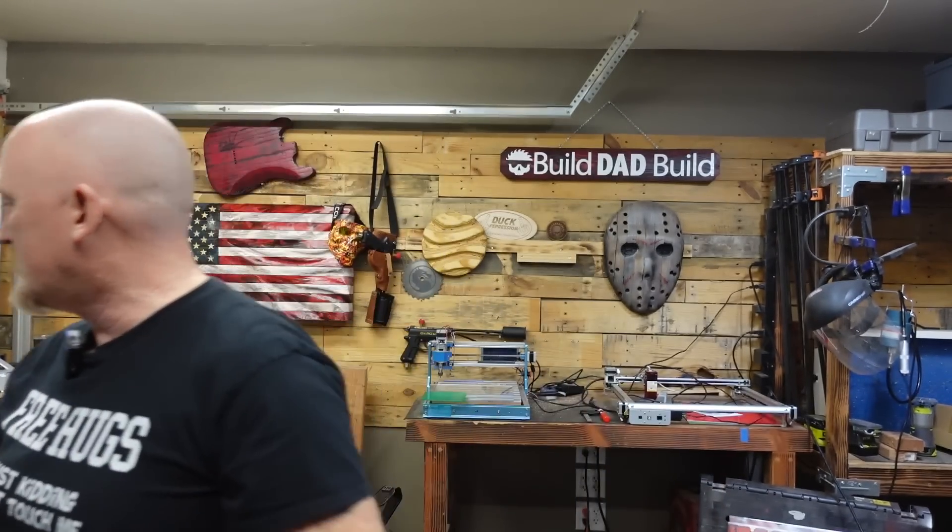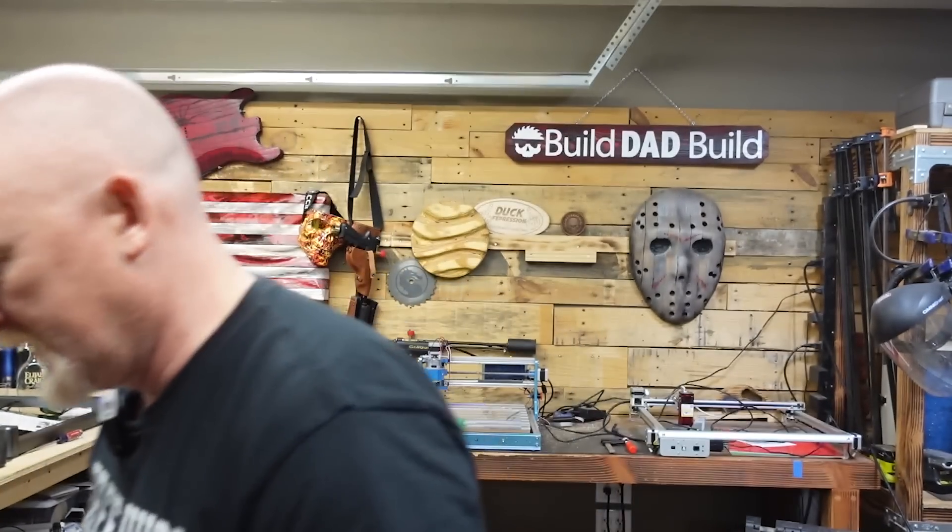Make sure that you secure your piece. What I use a lot of the time are these really flat magnets — that's three of them stacked. They're really thin, so a lot of times the laser will pass right over them, and I stack them as needed for whatever material I'm using. I can link these in the description below — these are pretty handy.